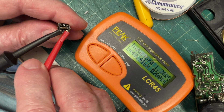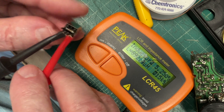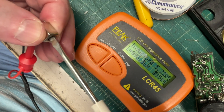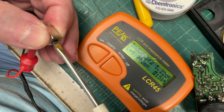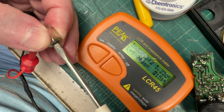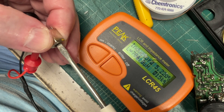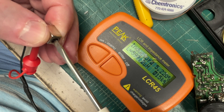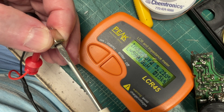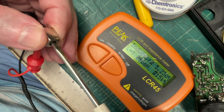On the secondary side: just north of one ohm DCR and 48 microhenries. Let me see the range of the inductance. I don't want to turn it any tighter than that — just north of one millihenry — and backing it out counterclockwise. It wants to stop right there, maybe a little more. 587 microhenries. So midpoint inductance-wise is somewhere around 825 — we'll just call it 826.